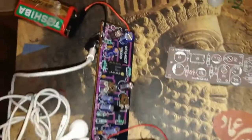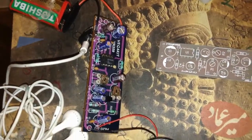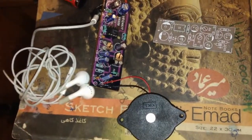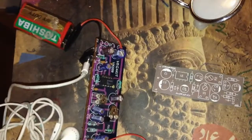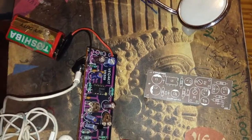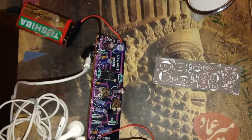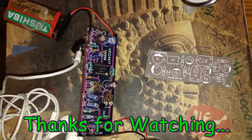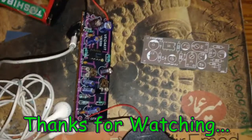The power is 9 volt for biomedical or biologic circuits. Never use DC-AC converters, for 2 reasons. First, for security reasons. Second, for the noise. With the battery, you are safe, and less than 12 milliamps, 9 volt is good and safe to test electronic projects.